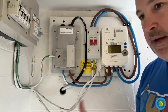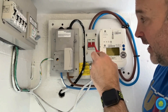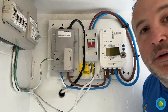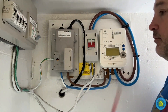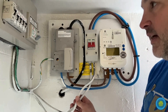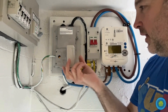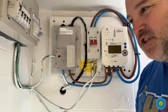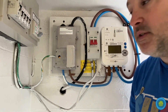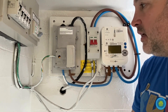As you know, if you don't pay your electricity bill they're here in a flash, but if you've got a problem it takes forever. But this now means I can cut the power when needed. Just think you can pull this out and take that out of the loop — you can't do that. That is the other reason why I will always call the DNO to pull this fuse, apart from the fact that it's dangerous — it's very dangerous.